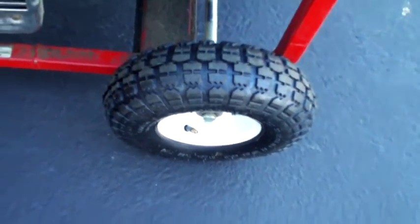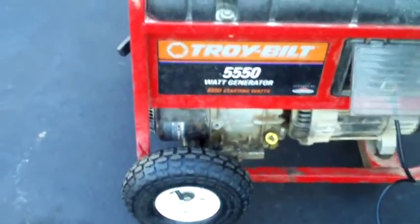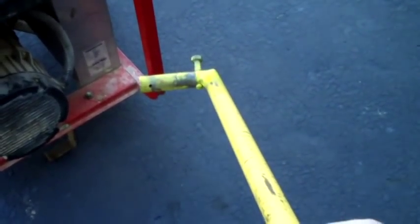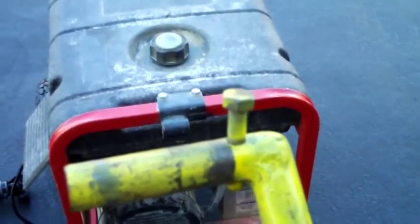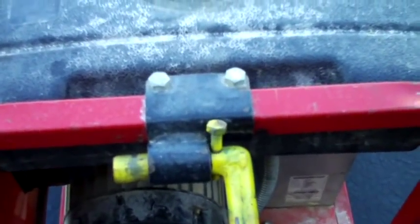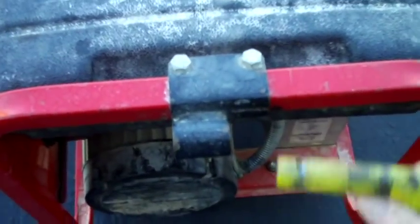I bought some tires for it — they're five bucks a piece. I went ahead and put two new tires on it because it only had one and only had half a rim on the other side. As far as the handle goes, we had an old combine, so I took one of the handles out of it and cut a notch, bent that tubing over to a 45. I re-welded the corner and I put a stop bolt right there. As you're putting it through and you lift it, it has something to grab onto so you can lift it up. There's also a hole for a pin so it doesn't come out.